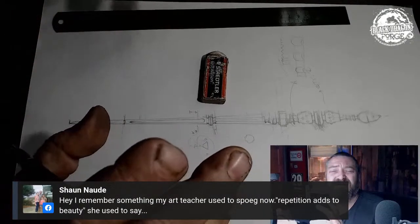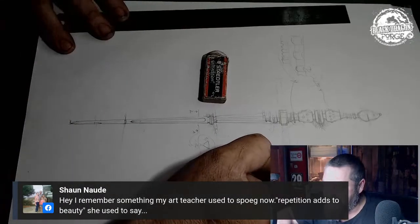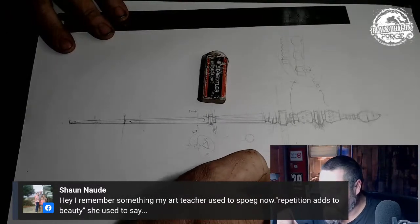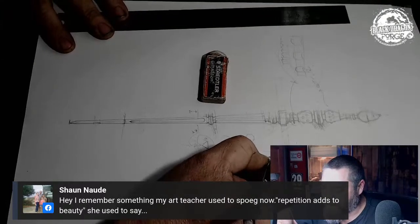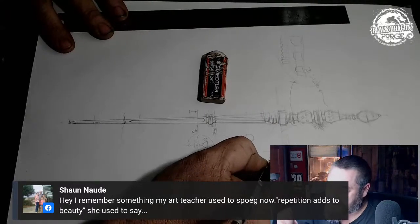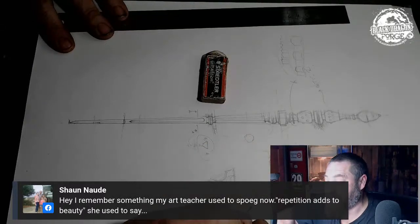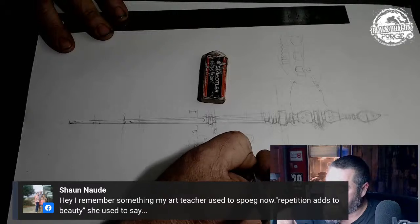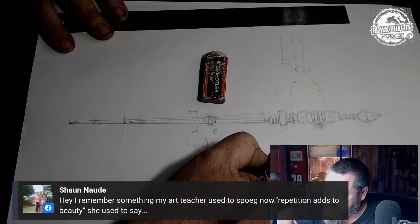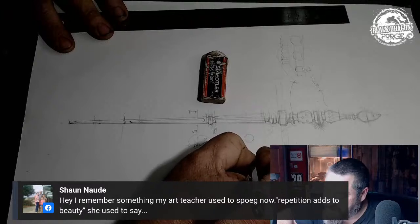And in a lot of 15th, 16th, even into the 17th century, you'll see piercings in blades where the blade comes down, and then there's fullers in it. For instance, there's one fuller, there's two fullers. So there's a fuller, and then it goes into the actual blade itself, right? So there's a fuller round. I can't do a round, half rounds. Okay, and it goes into the blade. So what the guys did was to drill a little hole and then oval it out. And then do a little triangle, for instance, and do another oval, then another little triangle, and another oval.